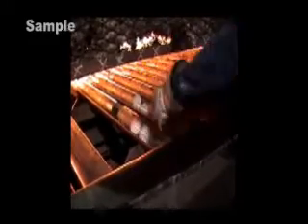The clevises are forged on a 2,500 ton press. The billets get pushed through a furnace and heated up to 2,200 degrees. The forge press operator takes the billet and hits it in three different impressions. The first impression is the buster die — the billet is stood up on end, the dies are flat and set to a specified length, breaking the scale off the billet and giving us the length needed for the second impression.